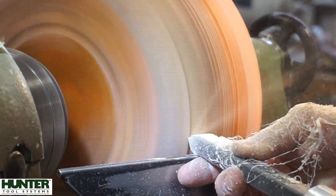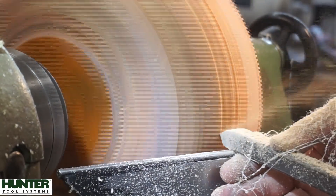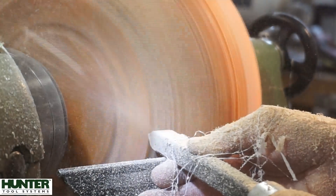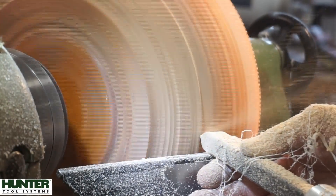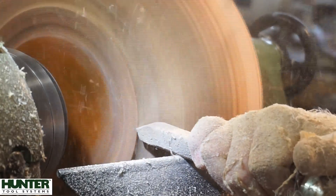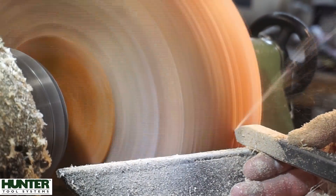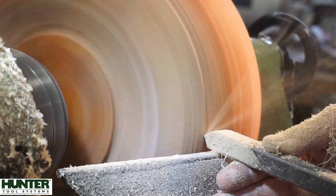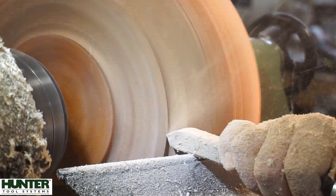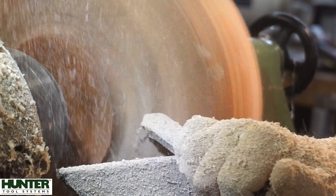The way I've done this casting today, it will showcase the resin more than the burl. If you had flipped the casting with the headstock on the tailstock side, you'd have a casting that shows more wood than resin. I knew that the color was an important part of this piece, so that's why I showcased the resin instead of the burl.